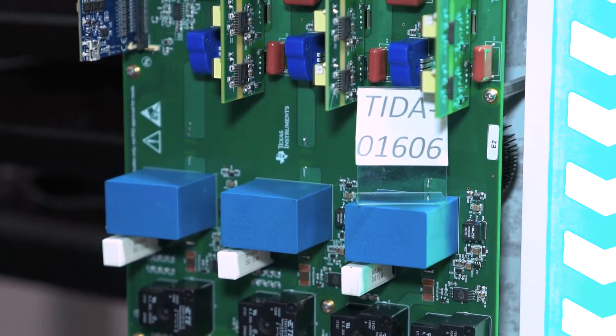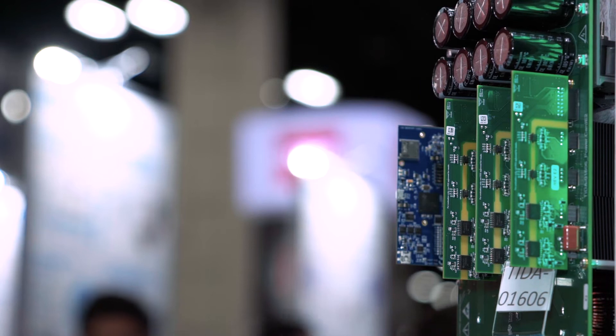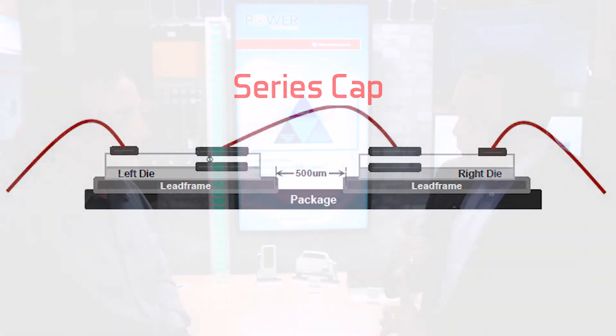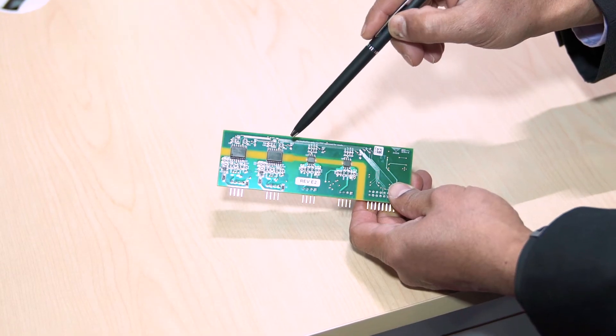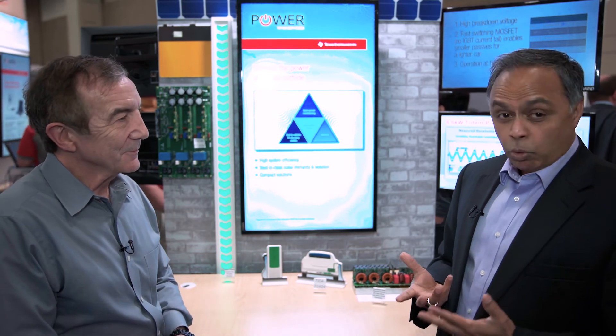The last and most important thing is TI's isolation technology. All these drivers, because of the high voltages, have isolation built in. TI's isolation is capacitive. We have the industry leading lifetime, highly robust. Our working voltage is around 1.5 kV, which means you can swing very high voltages from high side to low side pretty robustly. And the surge for our capacitive isolation is 12.5 kV, which means you can achieve reinforced isolation — a certification required for many of these robust equipment solutions.